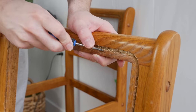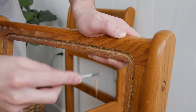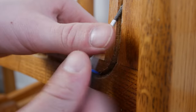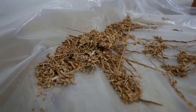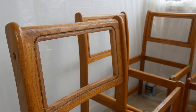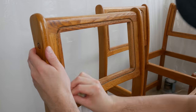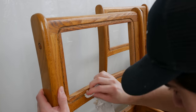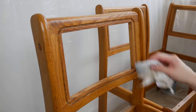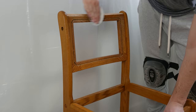Sometimes there's more glue and the spline does not come out super easily, so I had to really work hard on this specific chair. I just used a small screwdriver and went around the edge to remove all the old cane webbing pieces, old spline, and glue. This does take a lot of time, I'll tell you that for free. When I was done I just took a little damp rag and cleaned the inside out even more.